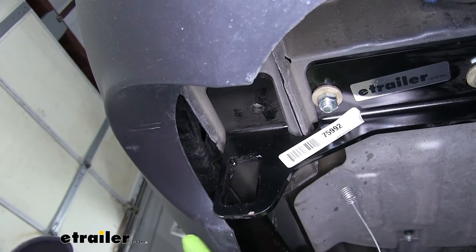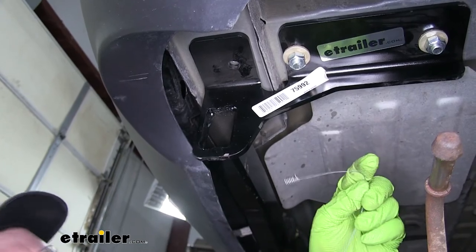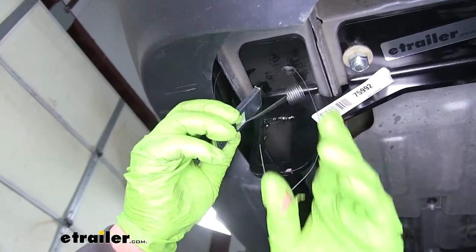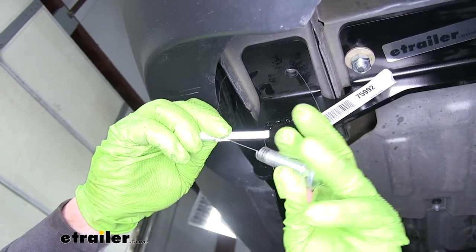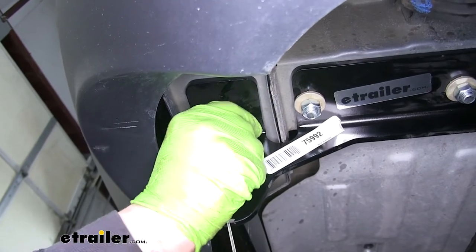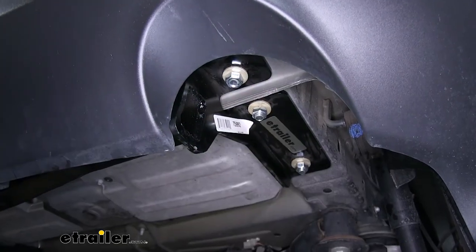I did find it makes it a little easier to get the coil out if we make a bend in it — maybe three or four inches down past the coil. We'll push that in and pull it down. Once again our spacer block goes on first, then our carriage bolt threads into the coils. Once it's dropped down through the hole, remove our fish wire and put on our conical tooth washer and our nut, then go ahead and tighten it down.